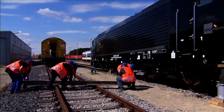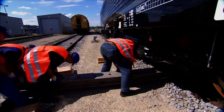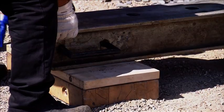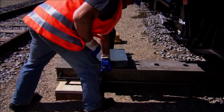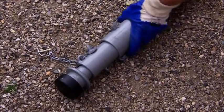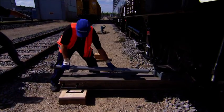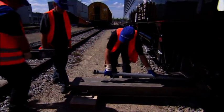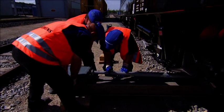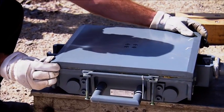The re-railing bridge is pushed under the raised locomotive. Roller carriages, which are connected to one another by means of a distance bar, are used for the lateral displacement of the locomotive. Roller carriages with rotatable and movable plates are used to absorb the relative movements that arise as a result of the lateral displacement.